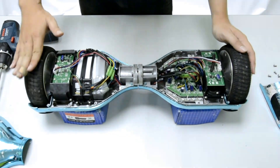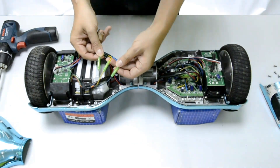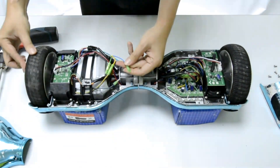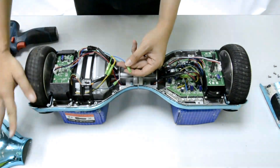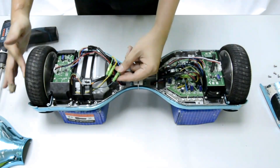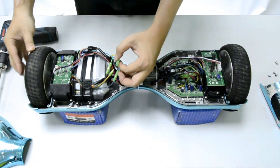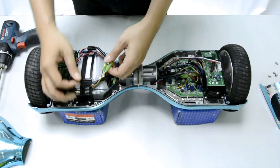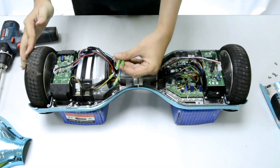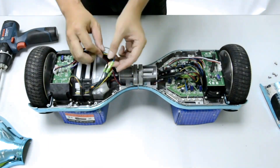The problem wheel is this one, connected through three cables plus one more. We'll disconnect them one by one to find which cable is causing the problem. Starting with the blue wire — bingo! After disconnecting the blue wire, the wheel runs smooth. Reconnecting it, the wheel is stuck again. Disconnecting the yellow wire as well, the wheel still runs smooth with two wires disconnected. So the short circuit is on the blue wire.